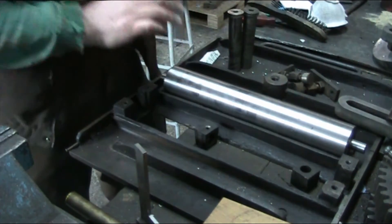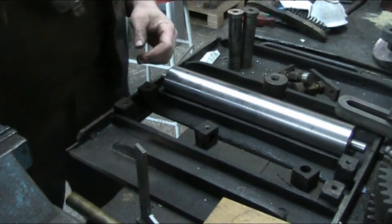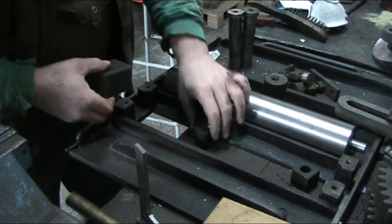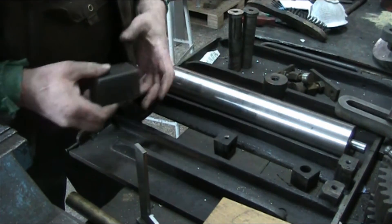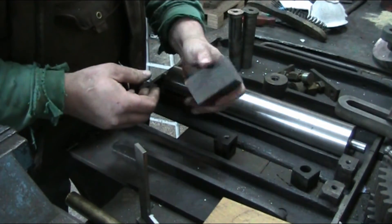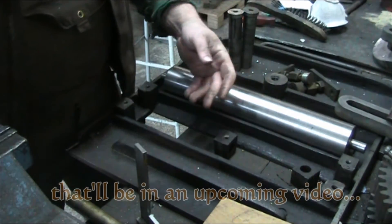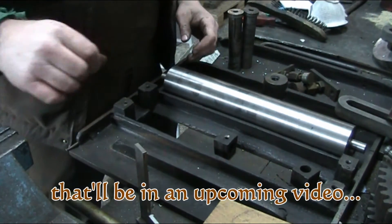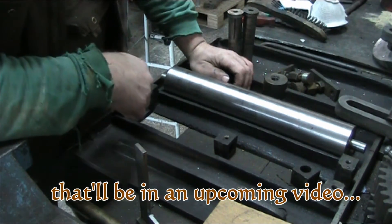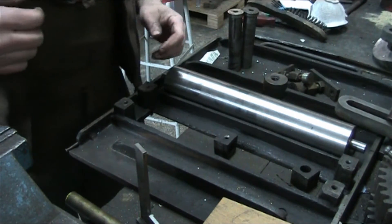What I'm going to do is make new bearing blocks out of this piece of cast iron on the mill. I've got enough here for six altogether, but that chunk I just cut off will make two of them. Let me turn around here and show you the gears.